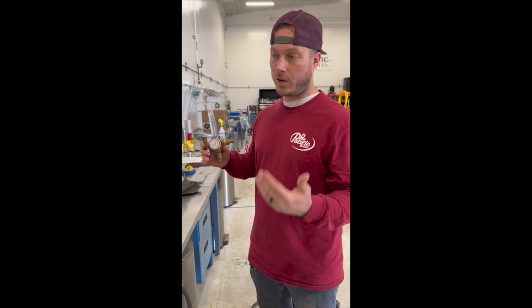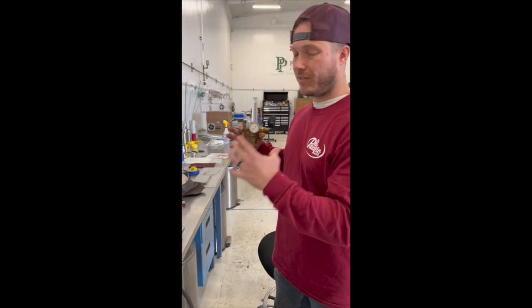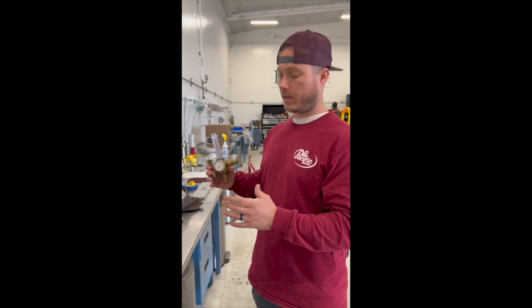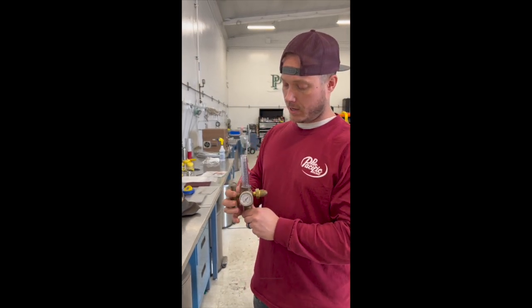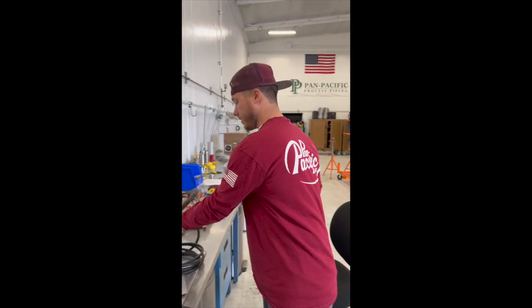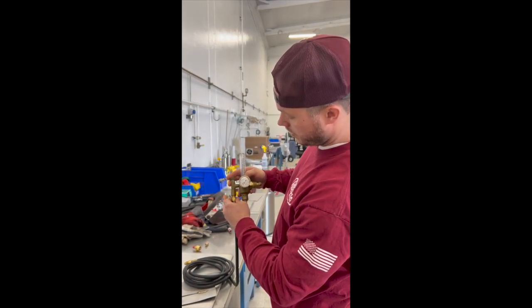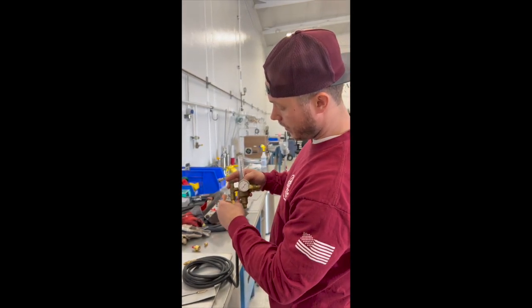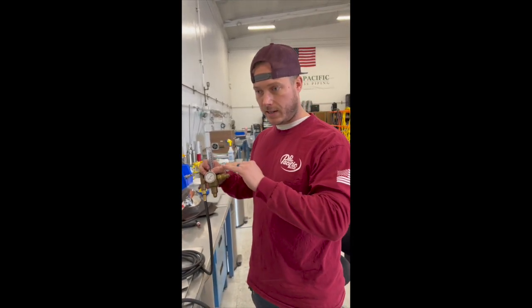This is basically what we always use in the field when we don't have a setup like Ricky has here with a big dewar. You'll have a tank, and this is probably what you'll be dealing with, a straight argon tank. You'll be screwing this right into it, just like oxygen or acetylene. And then you'll connect your argon hose right here, and for the most part you can plug it directly into the back of your machine if it has that adapter to connect to the hose and spray out.